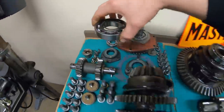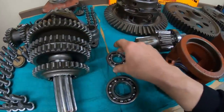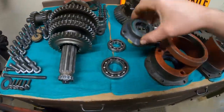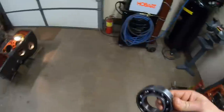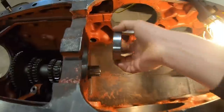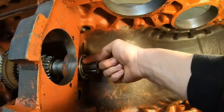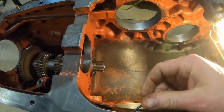All right, it's about to get a little bit complicated. See if you can follow me. So here are the two countershaft bearings, and we have our front bearing retainer. We need the rear bearing with the snap ring because that has to be driven onto the back of the shaft. Remember, we pulled this off with a puller, so we are going to have to carefully tap around the inner race, get it seated enough to get that ring in place.